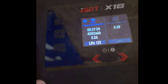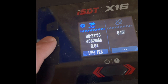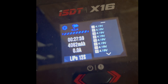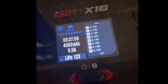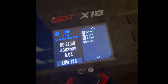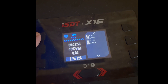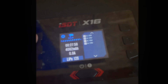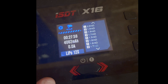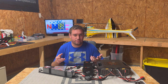I left this battery fully charged — it only took 4,000 milliamps in it and took 30 minutes to fully charge and balance at 10 amps. As you can see, the balance looks really good. It's actually sat for a little bit after charging. Let's look at the IRs — they look pretty good, all pretty balanced. I think that technique and those results really speak for themselves.